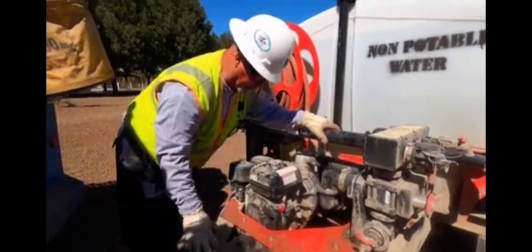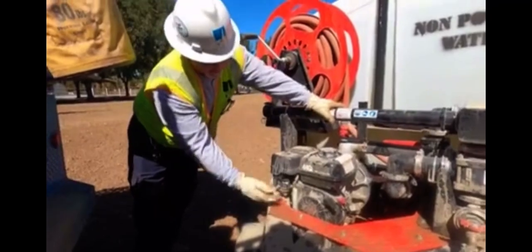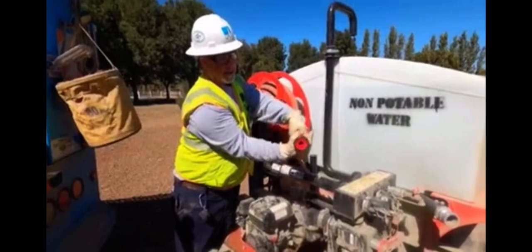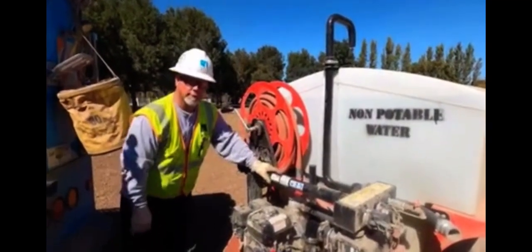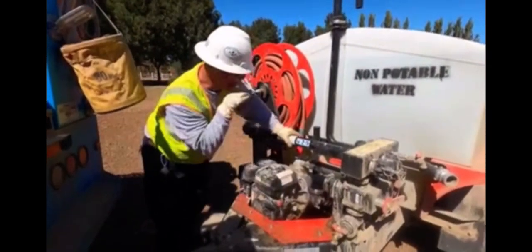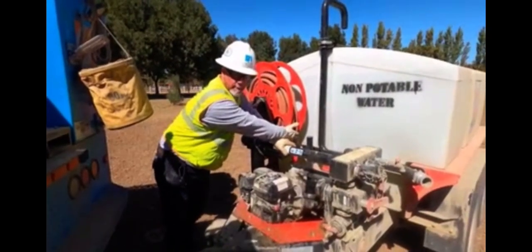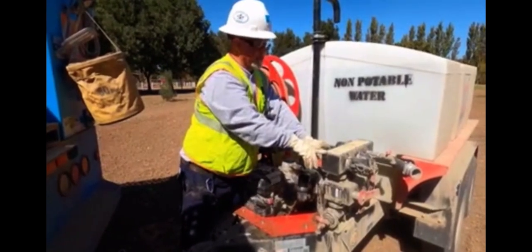I'm going to go ahead and throw it to on, which would be in the down position. My fuel lever, choke lever, and throttle lever are right here. The nozzle is fully closed when turned to the right and fully open when turned to the left, so we want to make sure that our nozzle is in the closed position before we start. Now that I'm choked, I'm going to pull start. As soon as I start this engine, this pump is going to put water and pressure into the manifold, so we want to make sure that's closed — that's real important.